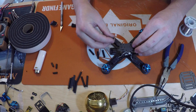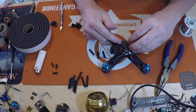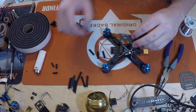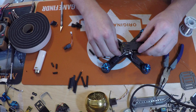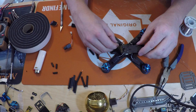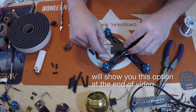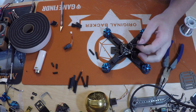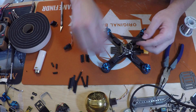I'm actually going to be able to mount this one just perfectly fine on an angle and get everything I need out of it. You can also grind some of this carbon out and mount in there too, or you could even cut this off and put two standoffs here. If you really want to get your FPV cam down in the bottom layer, you can just cut this off right here and have an open spot. So you've got a lot of possibilities - you'll have to do a little bit of fabricating for that, but it's not required.